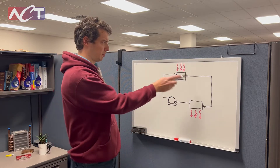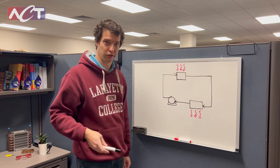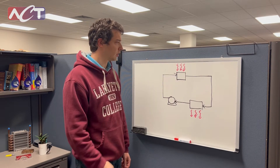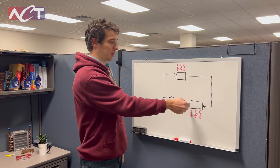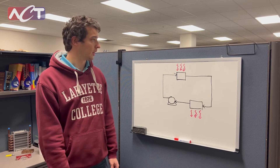What you have here is a pretty basic liquid cooling system. You've got your heat input — this would be through your laser diodes into a cold plate — and then some type of heat rejection system here, with the pump pumping your single-phase cooling loop.